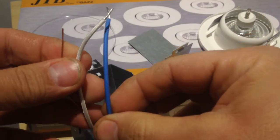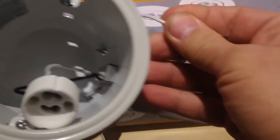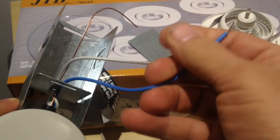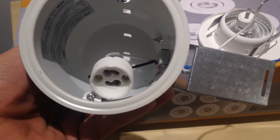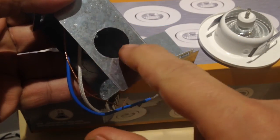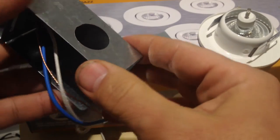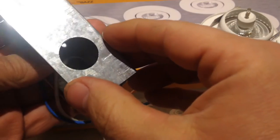This is the electrical box. You have three wires: ground, neutral, and the hot wire — the blue wire is hot. When you install the fixture, remove the knockouts by hand so your cable goes in. To protect the cable from sharp edges, buy a special connector from the hardware store. The connector goes in first, then your cable passes through — it's cheap, maybe a quarter.